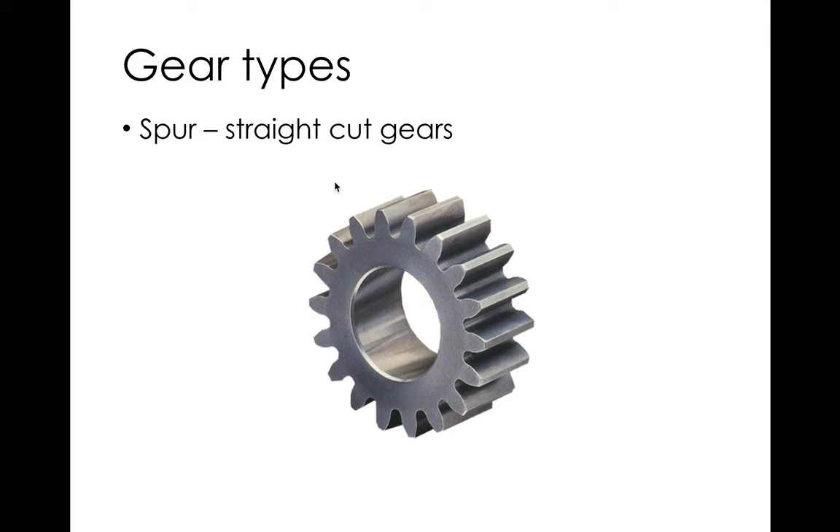It can be pretty annoying. A familiar example: in older manual transmissions, the reverse gear was a straight cut gear, so in reverse the transmission would sound different from the forward gears, which are almost always helical. Even helical reverses are common nowadays. If your manual transmission whines in reverse, that's why. On superchargers like root-style blowers, a lot of that whine is actually the straight cut gear noise — they could use helical gears and make it quiet, but that's not as fun.